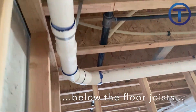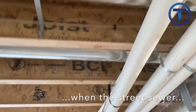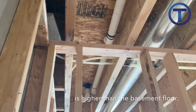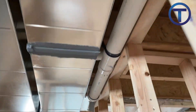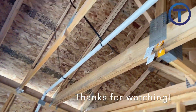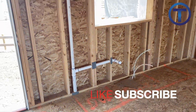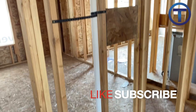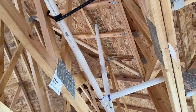Let's have one more look from the basement going upstairs — I've got the main drains run through the trunk lines with branches coming off for fixtures wherever needed. Where possible I keep it by the ducts so they can just box out around it and minimize intrusion in the basement ceiling. On this house I'm hanging the drains because the sewer elevation coming into the house is higher than the basement level. Thank you for watching — please give me your comments, like this video, subscribe to the channel, and don't forget to have fun when you're out there installing drain, waste, and vent systems.